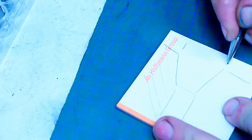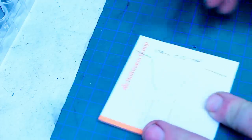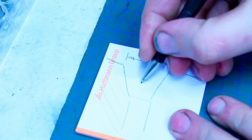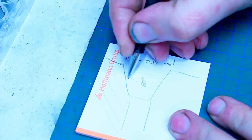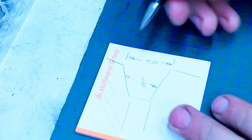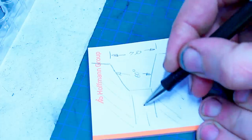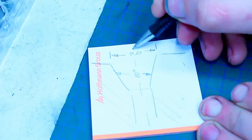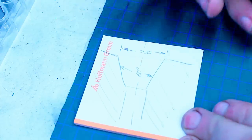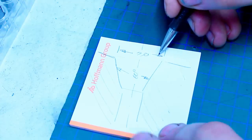And it was dimensioned here, diameter 4. The large end of this 60 degree countersink was dimensioned with diameter 4. We need cross hatching here too, and a center line, because we're civilized people here. So this diameter 4 doesn't help me when I do the machining.